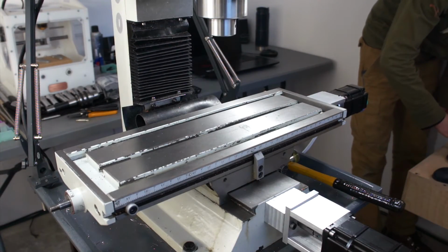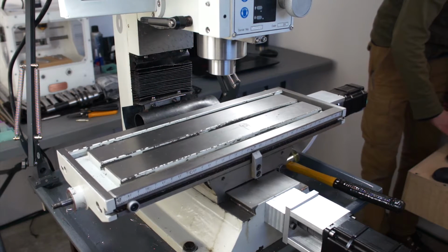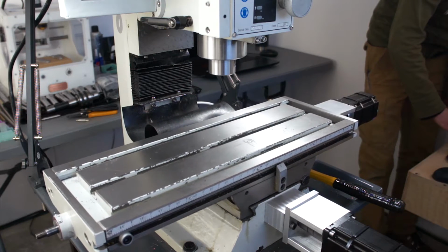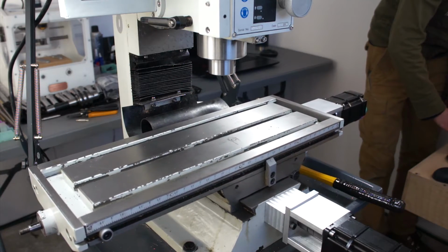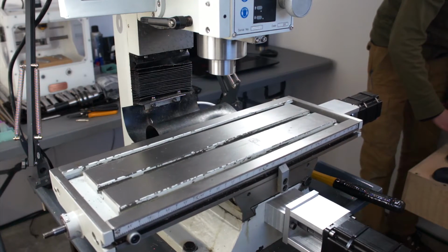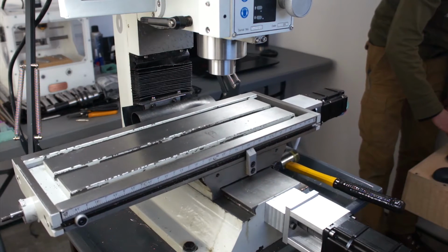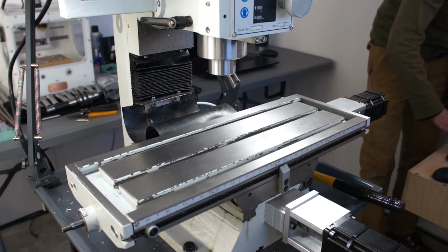This is the real-time speed of the CNC. The Z-axis moves at about 45 inches per minute. Maximum, I think, rapid I can get is 60 inches per minute. And the XY table, I can get it up to about 100 inches per minute, but I think I have it set here at 85 inches per minute, just to help deal with cutting loads and to avoid missing steps. You don't want to be running right at the ragged edge of what's possible.